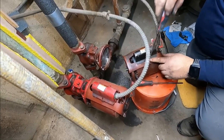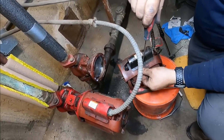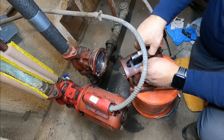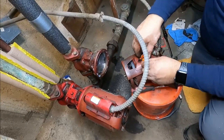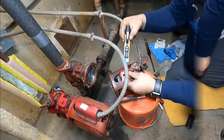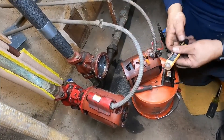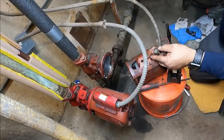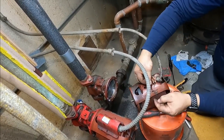I'm gonna remove the power cord because I have to remove this bracket. Even though I killed the power, I'm gonna check again to see if there's power - and there's no power. Check twice. Sometimes you think you killed the power but the wires go around some box and pick up other wires.